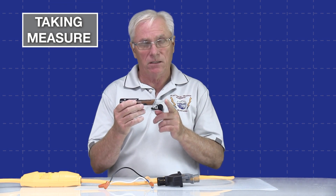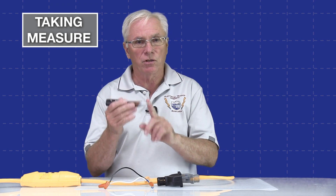I just wanted to close by mentioning again: these are a very good tool, but they cannot be used to prove you have de-energized a circuit before working on it — that's very critical. Also, you might have noticed the sensor flash a couple of times when I moved it around. They're very sensitive and sometimes will give you a quick little flash even when there is not an energized circuit there. You need to hold it for a few moments to make sure it continues to confirm whether you have a live circuit or not.